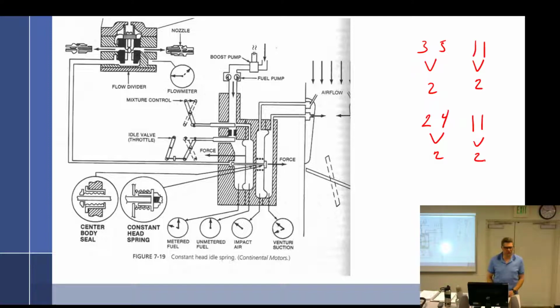But how did we get less fuel now? Less flow. How does it block the unmetered channel without fully closing it? Well, remember, this is just a representation drawing. They're actually rotating discs. Would that work? Yeah. Here's why I think it would work. We're in balance, so the poppet's where it's got to be, because you can't reduce the airflow and you can't reduce air metering force, right? Tell me if I'm wrong, because the book doesn't say this. You just got to kind of extrapolate.